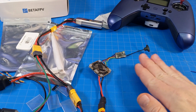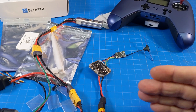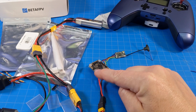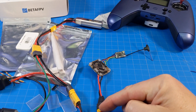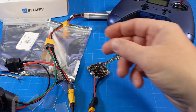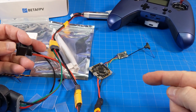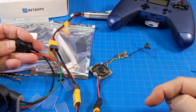If you're new to this, this might be the first time seeing this process. Similar to my Happy Model videos — if your board powers the receiver via USB, you can plug in three times and it'll go into binding mode. If not, you have to use the battery lead, or in my case a short saver with a switch. You'll see a blue light on the receiver — hit power on and off, wait for the light, and repeat that three times to enter binding mode.